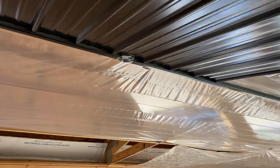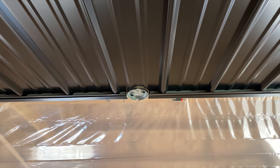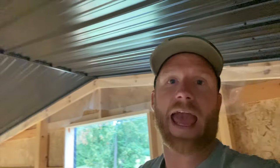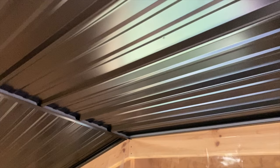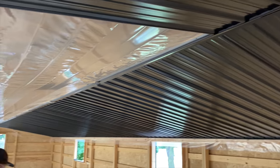We're cutting around these electrical boxes using a template — it's going to get a trim ring in the end. You can see this is probably just about an eighth inch off center, but no big deal. Now that we've got the other side of steel going up on the ceiling, right back here is where our attic access panel is going to be. Instead of cutting that out at the time of installing the steel, we put marks from the top side. We put the steel up and then go up and punch a hole about a half inch in from the framing on all four corners so we can do all the work right here later and trim it out. We're also making sure these ribs are lining up from side to side.